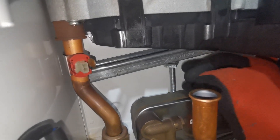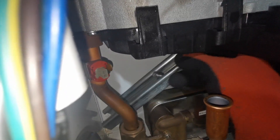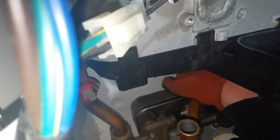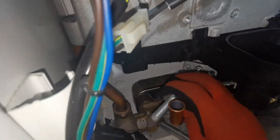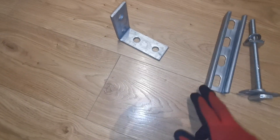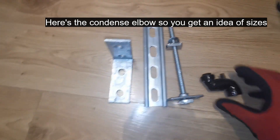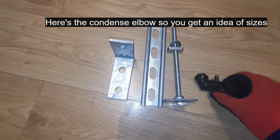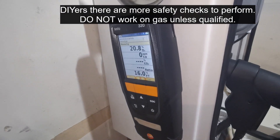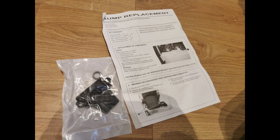There's not very good visibility on those back three clips, so you have to do your safety checks to make sure you've made a good seal. Rebuild the boiler in reverse order, grease up what needs to be greased, fill your trap, do your safety checks — job done.